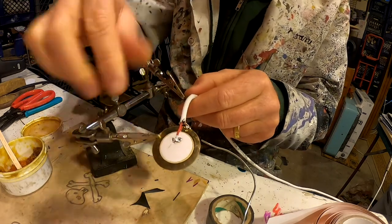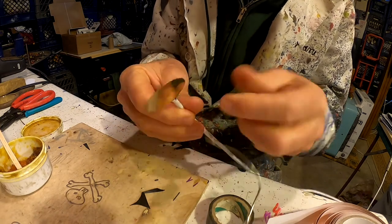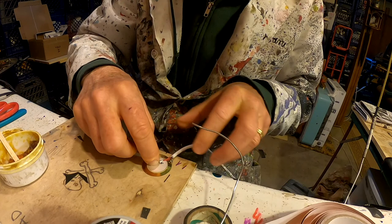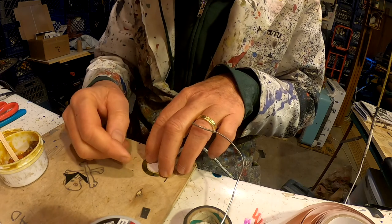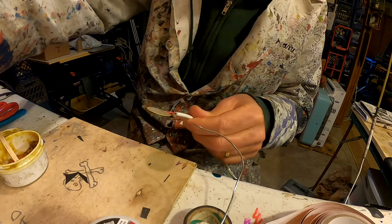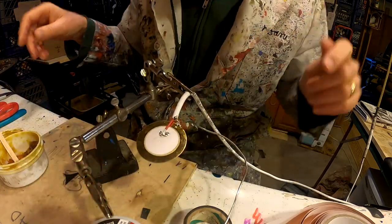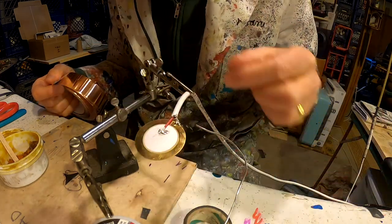Now, I have in my possession a piezo contact microphone that will pick up the slightest vibration. Hear that hum? We don't want that. So that's why we continue on with the next step. All right, clip that thing in place. Next step is applying copper all around it. This shields the contact microphone, just like the inside of this wire is shielded.